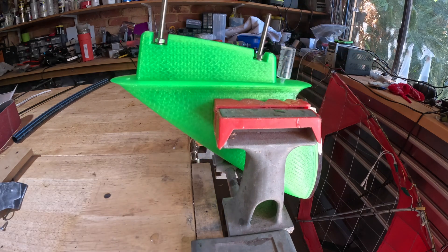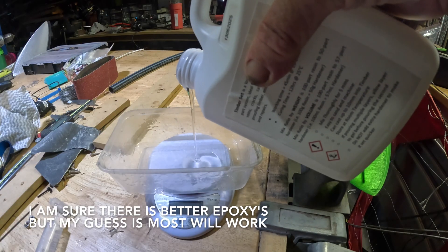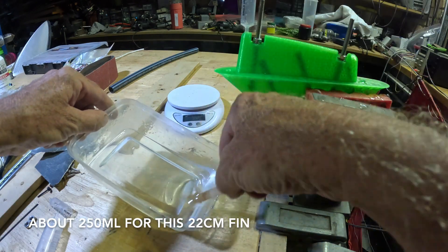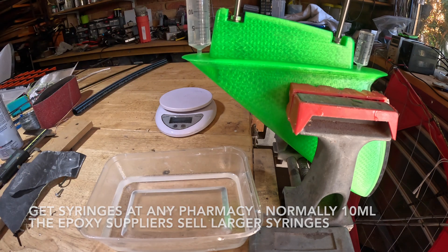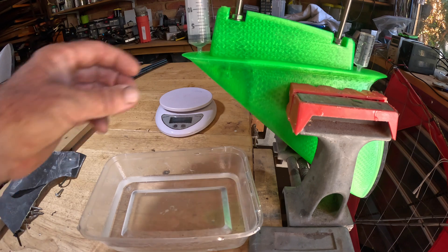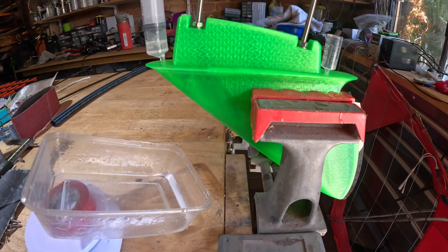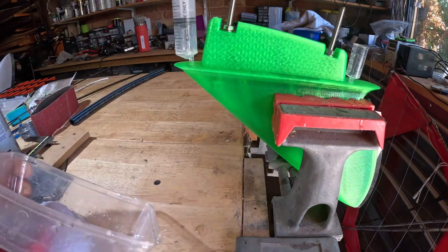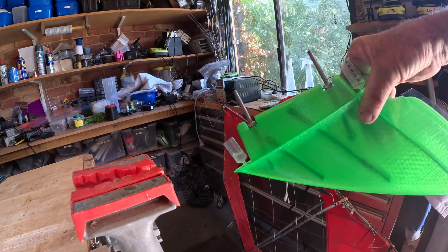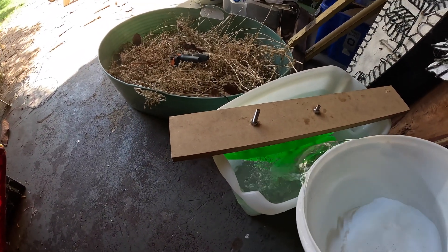Place the fin horizontally in a vise with plastic jaws or other protection and install one of the syringe reservoirs. Mix up the epoxy — the stuff I use is what people make colourful resin tables and artwork out of, as my supplier said that was the stiffest epoxy they sell. You can calculate the volume of epoxy required from your CAD program. Get another syringe and start filling the fin — don't press the syringe all the way down as this will inject air bubbles into the fin. Keep going until the epoxy comes out on the opposite reservoir. Then add the other reservoir and put a smaller amount of epoxy in that. Then rock the fin back and forth to remove air bubbles. However if you notice the fin getting hot to touch, it's time to remount the hanging jig and place it in the water bath.